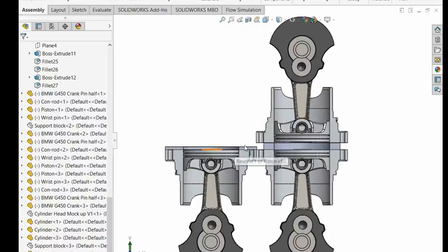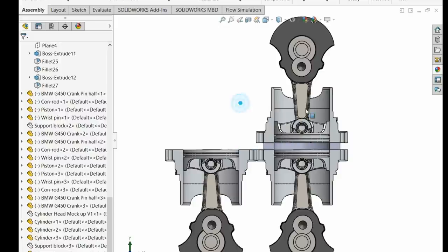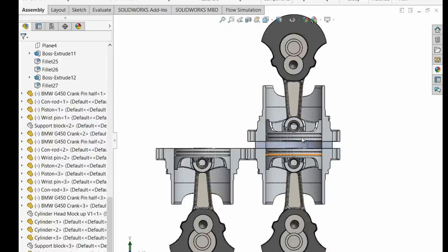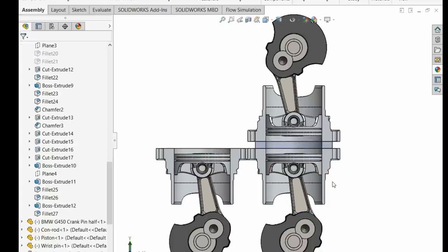We just chuck the cylinder head in the bin and then we basically just double one up on top of the other. So we get this system and we create this system. That's all we're doing, basically. Now, like I say, there are slight things you can eke out of it if you're just quite clever. And with diesel, it works a lot better. So that hence why you see a lot of these opposed piston engines running diesel, that kind of thing.